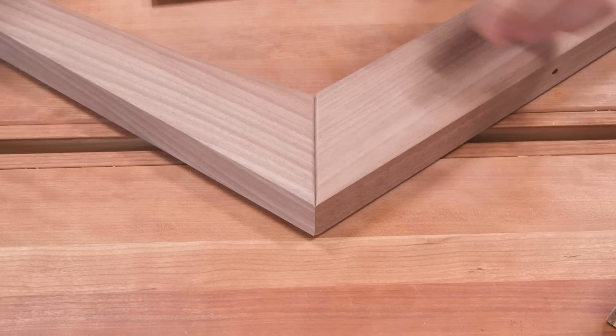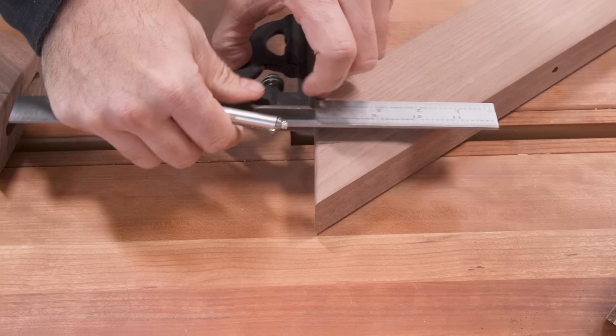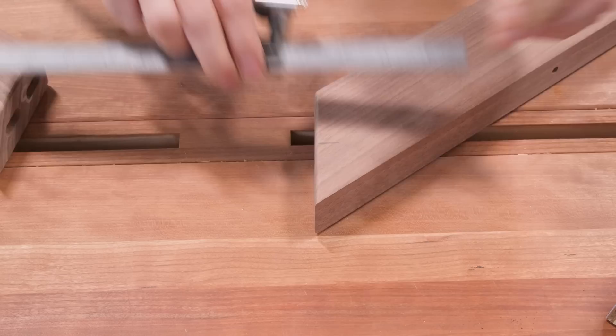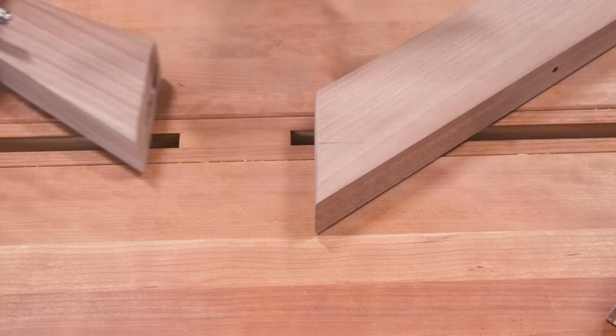When the joint is together, I like to find the center of the joint — this is just by eye, but you could certainly measure. Then I grab a square and extend that line, because I want to stay perpendicular to the joint. I don't care what the angles are on either side; what I want is the perpendicular line at the center point of the joint. Go lightly because you're probably on a finished surface and you'll have to sand this out later.